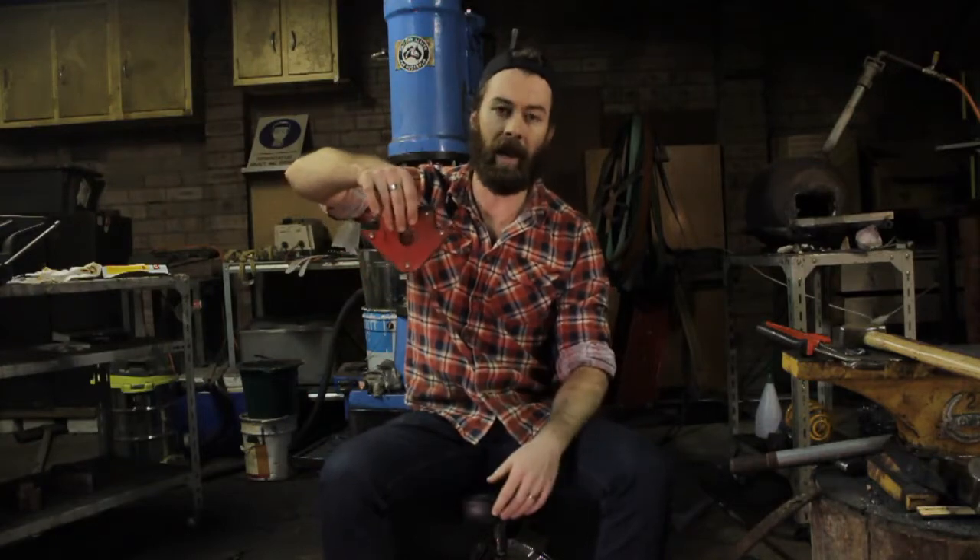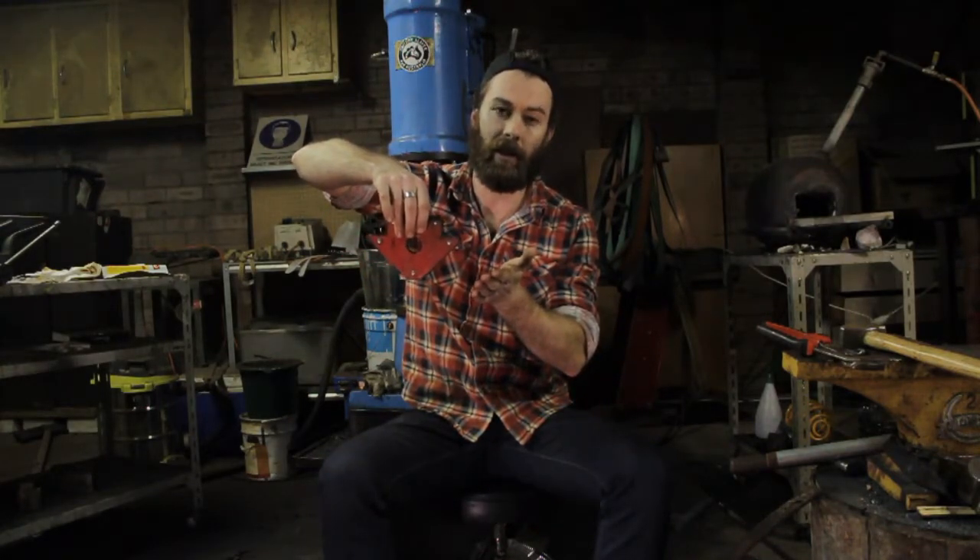I feel like I get a little bit sidetracked talking about steel. Just to summarise: 1084 and 1075 are great steels for beginners because they can be done with very rudimentary equipment. The temperature that they heat treat at isn't terribly high — 815 to 830 degrees, which is just past their critical temperature, around where they become non-magnetic. That's another great feature of these steels: you can test them with a magnet as they start to look an orange colour. Don't heat treat steel by going off the colour alone. With 1084 and 1075, get yourself a good magnet — I like to use welders magnets because I can stick them to things or tie them up and let them dangle. As I hold a piece of steel closer, if it's still magnetic I'll see the magnet angling towards it. You'll easily have means of telling if you're heat treating them correctly as you're heat treating them.